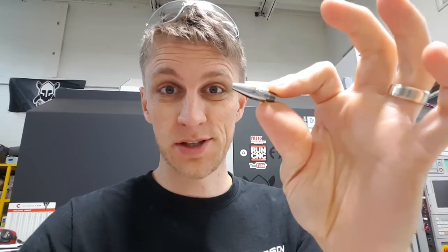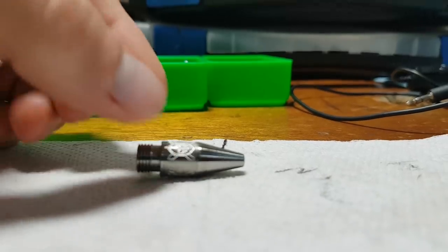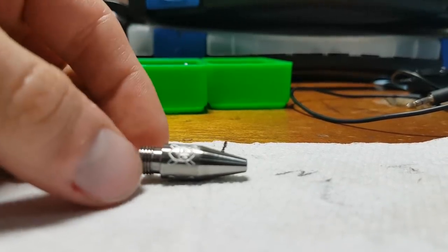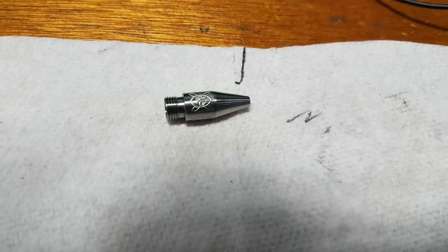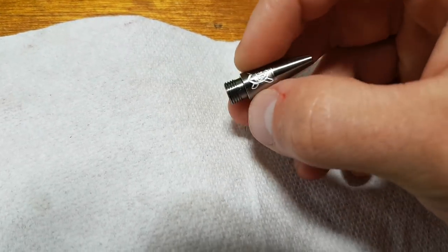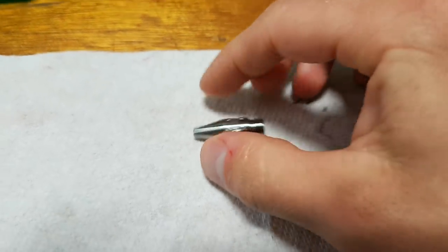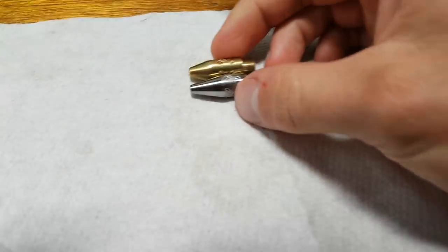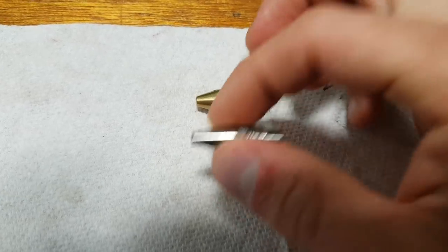What's up guys, it is Sunday, I'm back at it again. I made one part yesterday in the four hours I was here, then had to stop because I ran out of time. Interesting thing — it was being drilled in the sub-collet and it was actually slipping in the collet because I'm not used to turning up the pressure so much. So I've got to turn up the clamping pressure. It didn't drill all the way through. Here's an old one compared to a new one — check out the profile. I made it pointier and I'm really happy with how that's going to turn out.